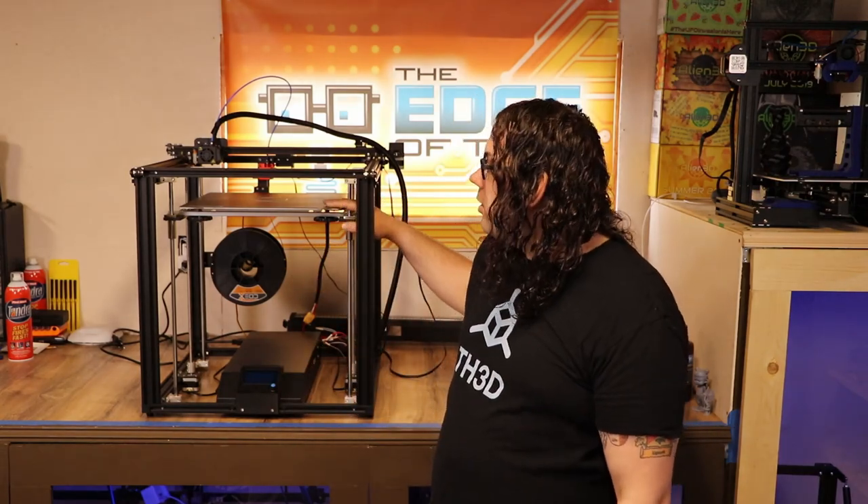I think I'm really happy with this upgrade — it was really easy to do and it's really going to help this Ender 5 Plus. Don't forget you want to make sure your bed is level again, just like you would do in the very beginning. Make sure everything is straight because we laid the machine on its side — it may have shifted. You may even want to do a manual bed leveling even though you have the BLTouch on there, just to get it really close.